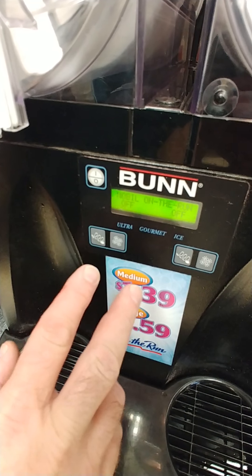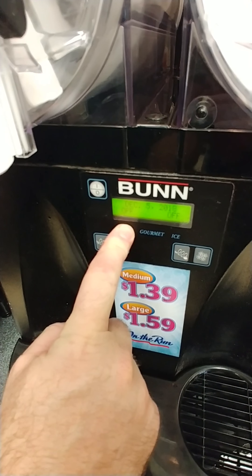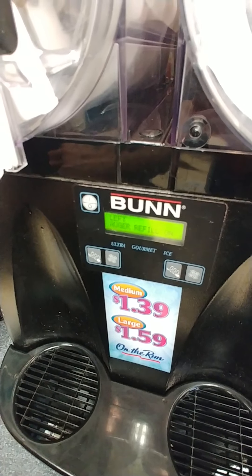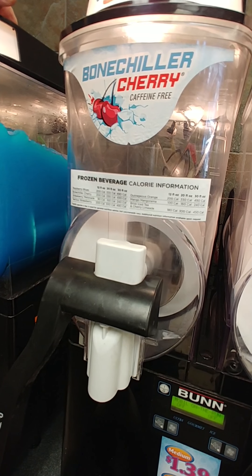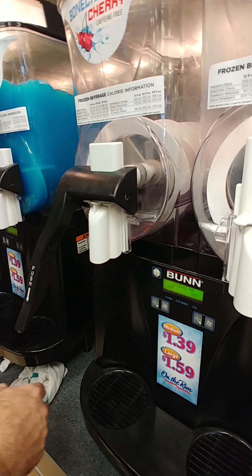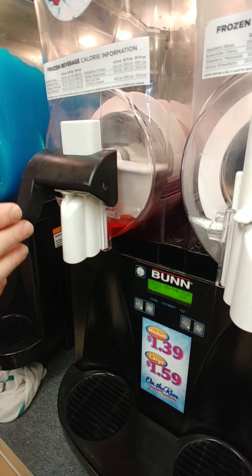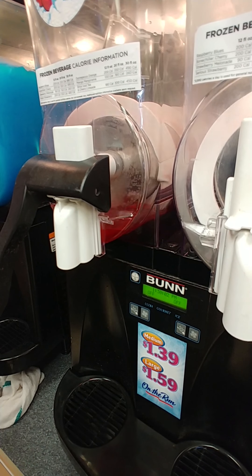To reset the air filter message once you're back to the normal screen, take the ultra button and hold it in for five seconds until it says filter clean, and then the filter clean message goes away. Then turn it on and start refilling the barrels — turn it to auger on, auger refill on. The auger will come on and a few seconds later it will start refilling with product. Wait until the hopper is full enough where it's over the evaporator barrel before turning it into ice mode — if it's not full, it starts freezing on the outside and the auger starts catching, so it needs to be submerged in liquid. Usually fill one barrel up first, then do the second barrel. After we do that and turn it on, our PM is complete.